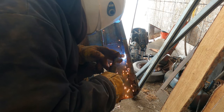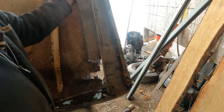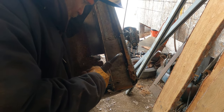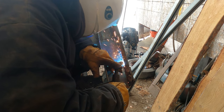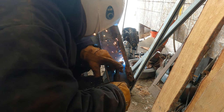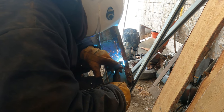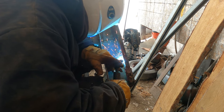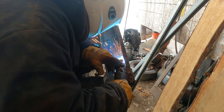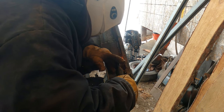different sizes and thicknesses of brass, and I would keep it in a Ziploc freezer bag in the freezer. I would keep that brass really cold, and I would hold it in behind the metal that I was welding, if I was able to reach in there. That way the brass would work as a heat sink, so it would draw the heat from the surrounding metal so it wouldn't warp while I was welding it. And it's also non-ferrous, so if there's any holes there, it works as a backer as well, and it won't stick to it, and won't blow through either when I'm welding it.